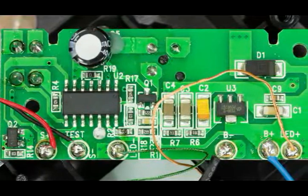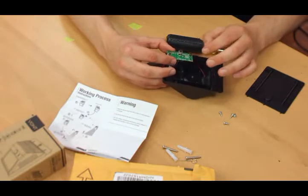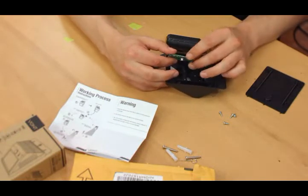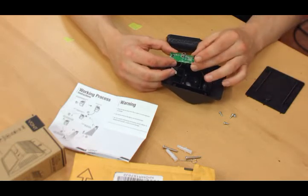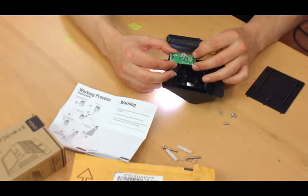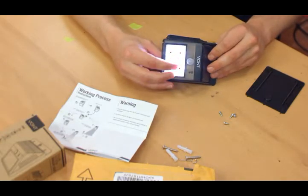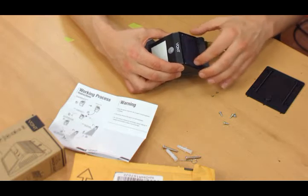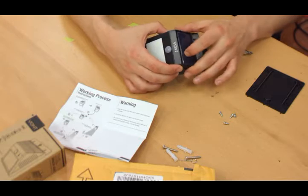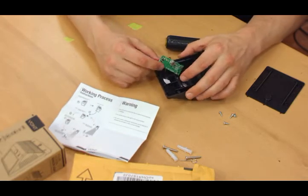Overall, the board seems fairly well laid out and well manufactured. All of the components are nicely aligned, and the soldering is very neat and orderly for the most part. Basically three major things are going on here: passive infrared detection, battery charging and discharging, and whatever microcontroller governs how long the light stays on, whether it goes into nightlight mode, and reading the power switch. There are no screws on the back obviously holding the solar panel or the LEDs, so I'm guessing those are either resin-molded onto the surface of the plastic or they're just one module that's glued in.